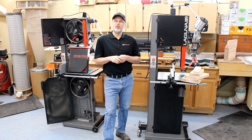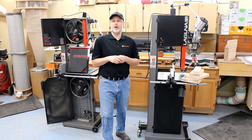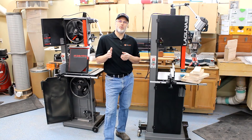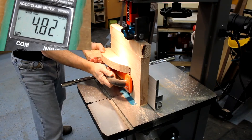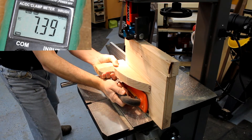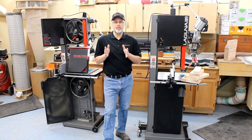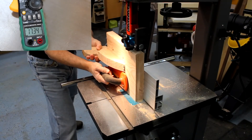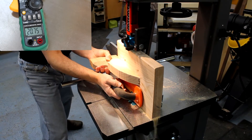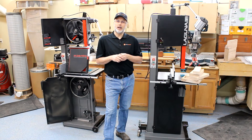The second area we looked at was the amperage draw on each saw while pushing them hard during resaw tests. The two and a half horse was drawing in the range of six to eight amps when pushed to the max — that's a cool running motor. The one and three quarter horse, when pushed hard, was up in the twenty amp range. So if you're going to run that saw on 110 volts, you'll want to make sure you have a dedicated 110 volt circuit and not push it too hard to avoid maxing out those amps.